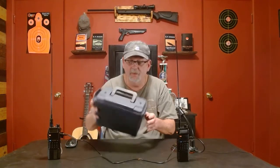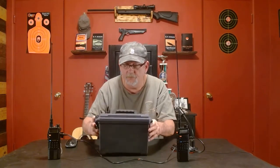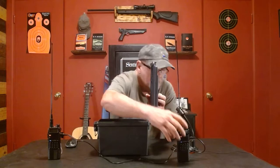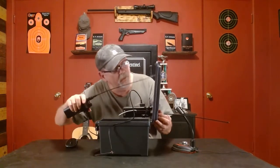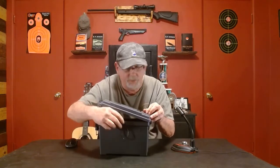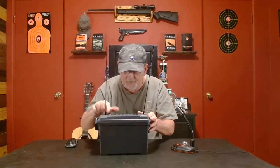What we're going to do is put all this in a nice little box — just a little plastic ammo can. I have three-eighths inch holes drilled in the top in the center, one inch from each end, because we're going to put those radios in there. It fits nice and tight and it's practically waterproof. We take the first radio and put it right in here, take the second radio and put it right there, then put that wire in there with it and shut this thing down. The top should be good and tight, because the way those holes fit over the antennas — the antenna actually gets wider from the top down — when you get to that three-eighths inch mark, those holes seal around it great.